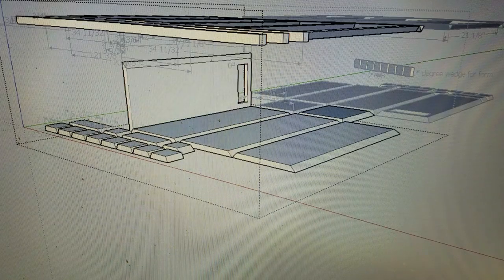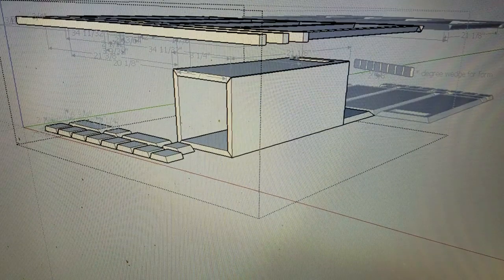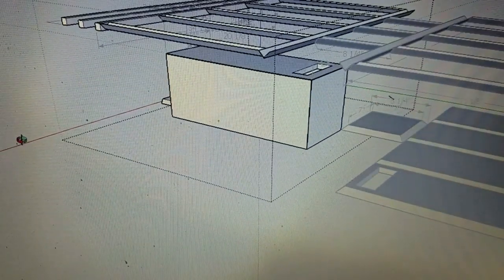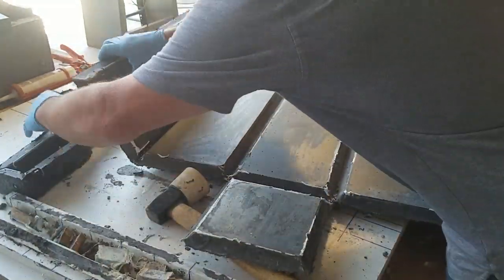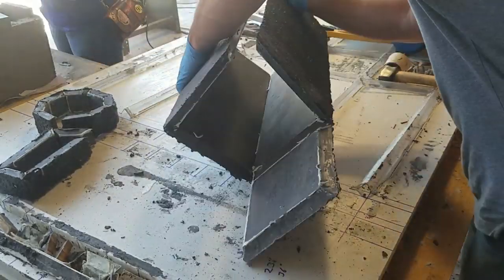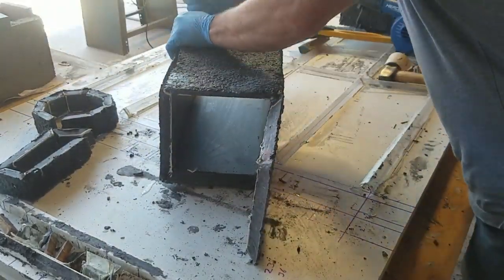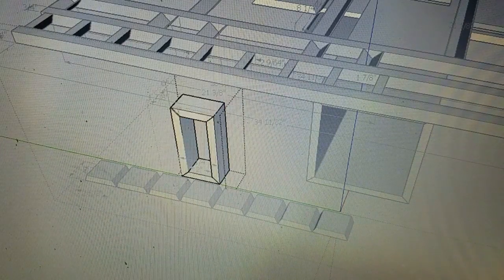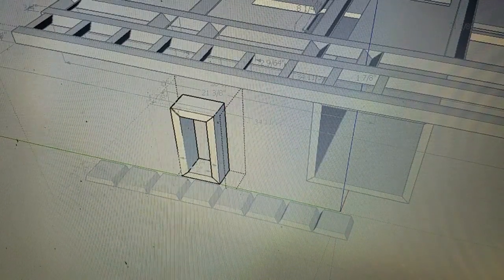If we go ahead and take a look at the firebox in its conceptual form, then that'll give us an opportunity to just imagine what it's going to look like in reality. All we have to do to finish this box is squirt some 3,000 degree mortar through a caulking tube into the V's and wrap it up in some bungees for a few hours.